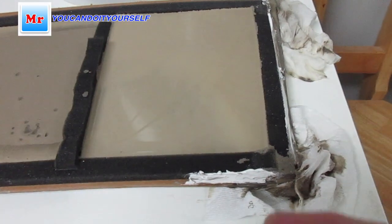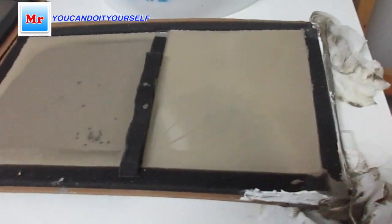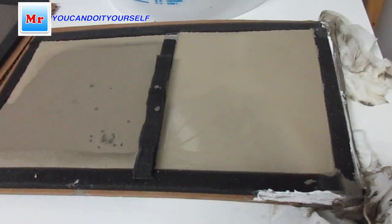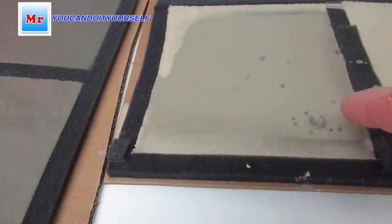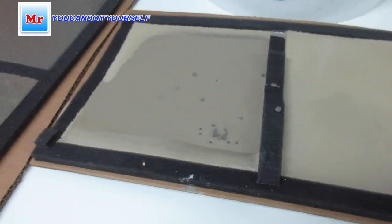So, and I have some little accident, you know, from Novoplan. Here, from under the foam, concrete is floating. Sometimes it happens when we're doing leveling. So be careful. Do good insulation, wall insulation. And you see, this self-level plus is getting solid faster. I would say it's like a premium self-leveling compound, but it's getting dry fast, and you have to work faster than with Novoplan 2.